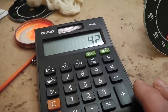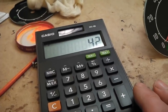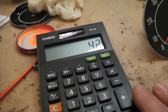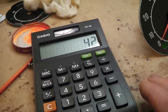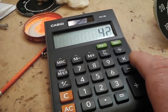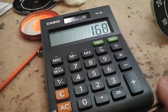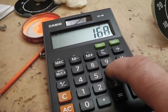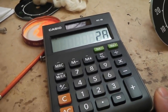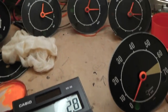Okay, because it's 6 seconds a day in a 24-hour period, so 42 seconds gained on the middle and far right hand side clock, because it is 6 seconds. So that is 42 seconds a week. Times by a month for 4, 168 seconds a month, divide by 60, 2 minutes a month. I can live with that. I'll say 3 minutes a month gained. That's fine, we can live with that.